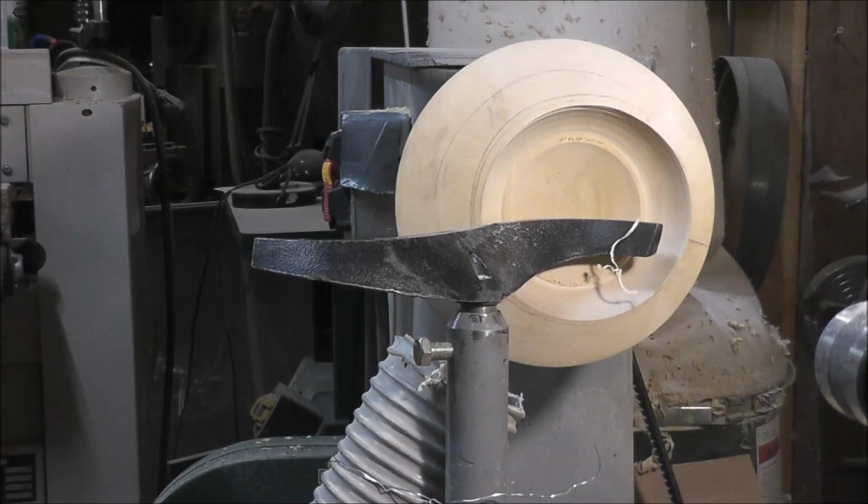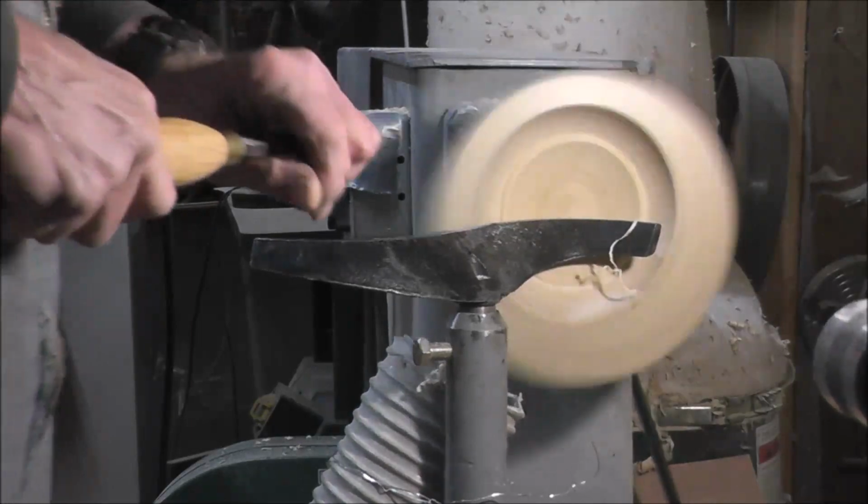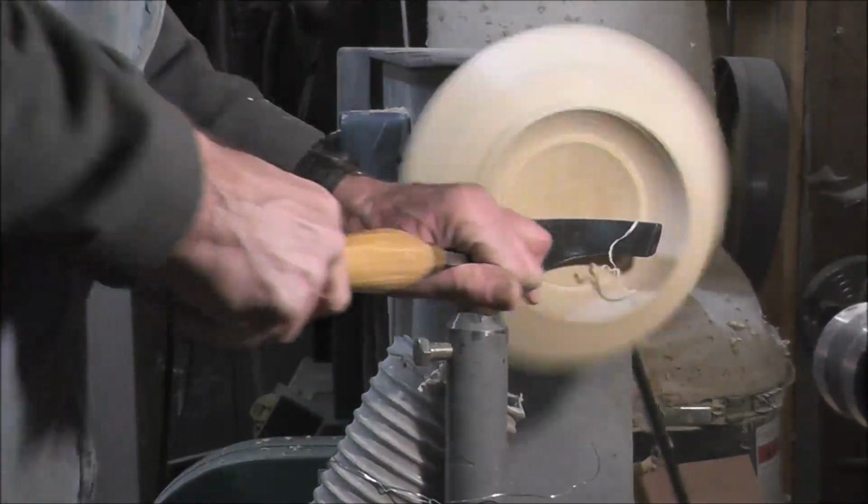Exciting. Well, I'm getting down to almost the size that I want there, and taking out a fair amount of wood. But I turned it up one speed. I just got step pulleys, but I went a little faster, and it seemed to smooth out a little bit better and not vibrate so much. So I'll show you how this is here. That sounds a lot better.